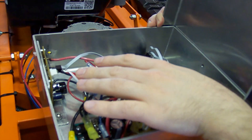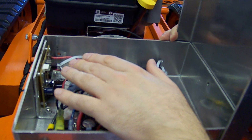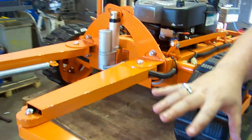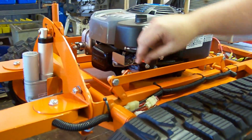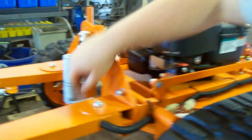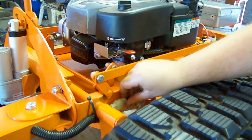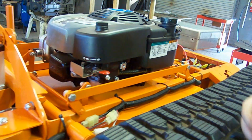And over here we have our universal controller that helps control the linear actuator of the trimmers for this unit. This was a bit of a project because there are a lot of moving pieces. There are wires that come in from over here and go through this pivot point, so we had to do a lot of creative thinking to make sure nothing got pinched or cut. You can see we have this wire loom coming out, and it's the same on the other side. Basically, the wires go through the arm and come out here, and the linear actuator also comes down here. We make a bundle — like a wiring harness — that comes together with some pretty strong connectors right here. That way, whenever you want to remove the attachment, you can just unplug it and take it off without too much hassle.